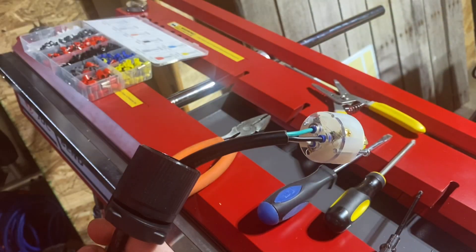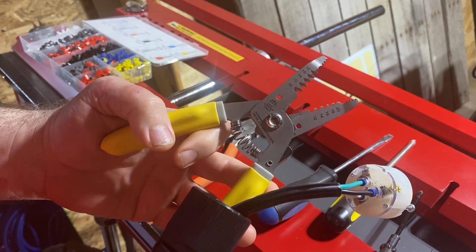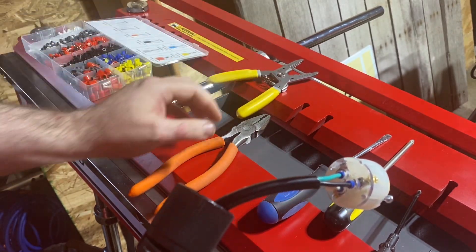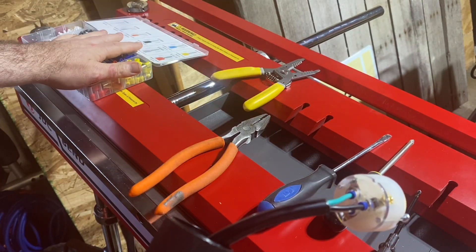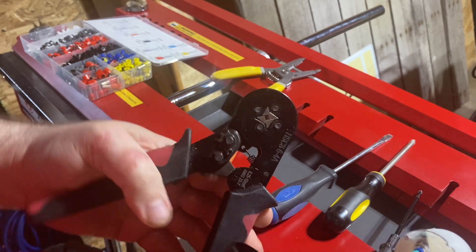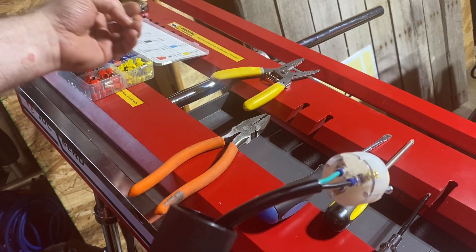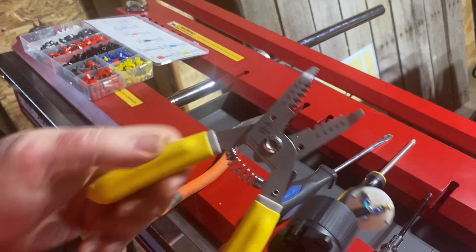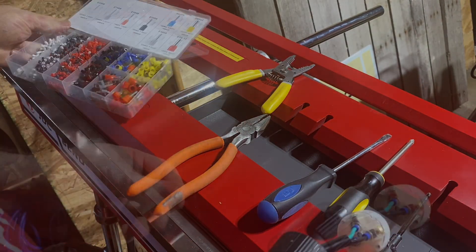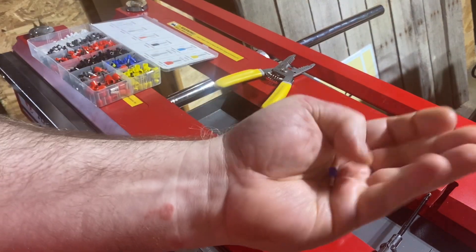It's better to clamp down on the ferrule. Use the wire cutters to get all three wires to the same length, then use the wire strippers to get just enough bare wire exposed for the barrel end of the ferrule — link in the description for the ferrules. Using this crimper tool, which is one of the neatest inventions, you press the barrel of the ferrule onto the wire. Forgive me, I did that off camera. This wire I'm guessing was about 14 gauge, and the blue ferrules are denoted in the packages as being for 14 gauge wire — which seemed like a perfect fit, so I used the blue ferrules.